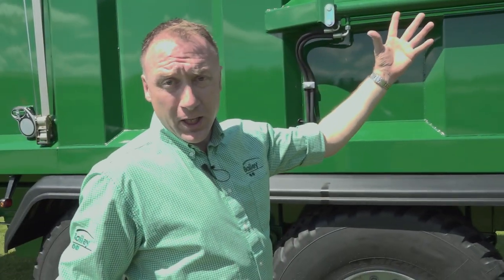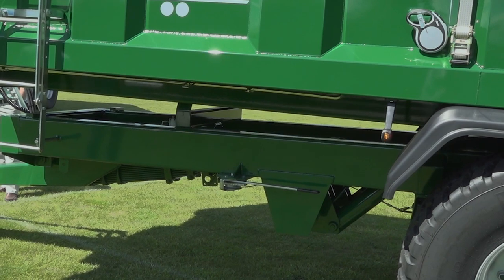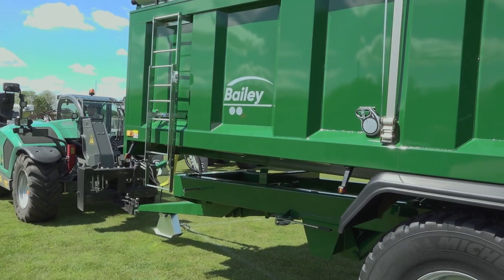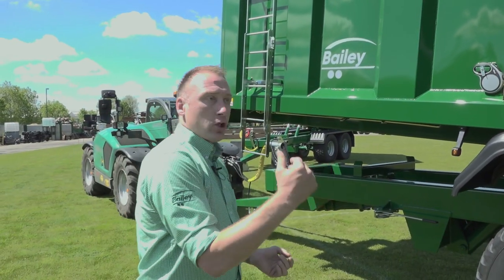To help with the door mechanism we have a lock valve underneath which stops oil moving backwards and forwards to lock the door shut when you put it down. To operate the tail door you have to lift the trailer up only about an inch to release the safety valve, so you cannot accidentally open the door going down the road.